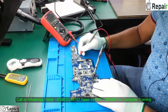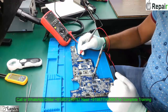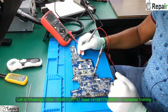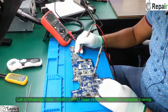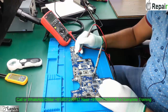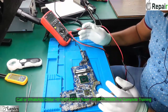This voltage is dropping before reaching the charging IC. If I cut off this resistance, no fluctuation is taking place, so everything looks fine, but however it is not getting on. When the 19 volt is dropping, that could also cause AC_IN to drop as well. You can see here pin number nine is AC_IN — it's completely dropping, as you can see on the multimeter.